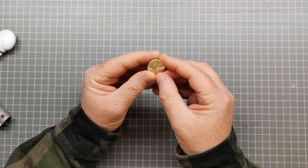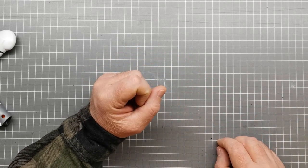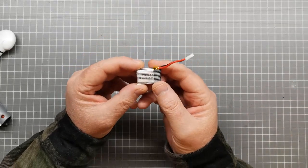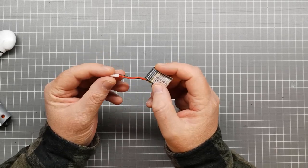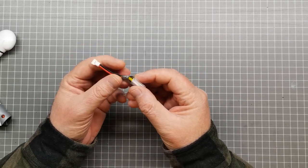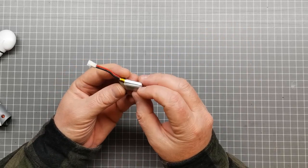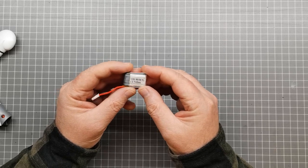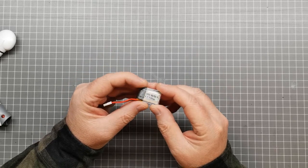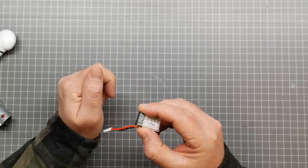I also want to talk about the power source. This coin cell battery is very commonly used in model lighting at 3 volts, but I'm going to need something with a little more charge. I'll be using this LiPo battery — 3.7 volts at 150 milliamps. It's rechargeable and comes with a USB charger. It has built-in circuitry to protect it from overcharging. These packages come in various voltages and capacities. I've chosen this one because it's small enough to fit within the model, fully enclosed, and it'll have a bit more life than a coin cell.